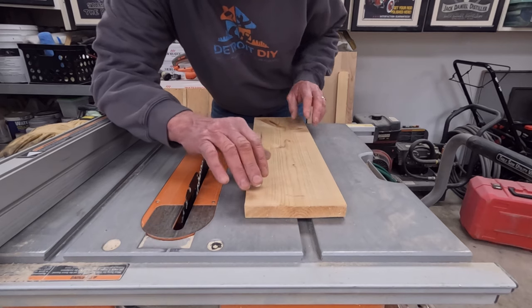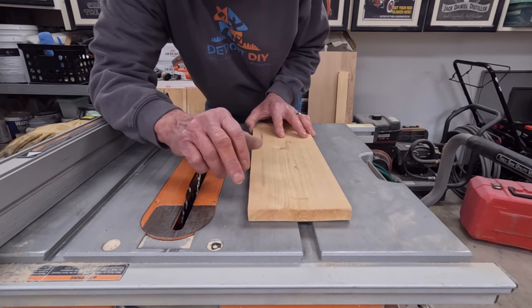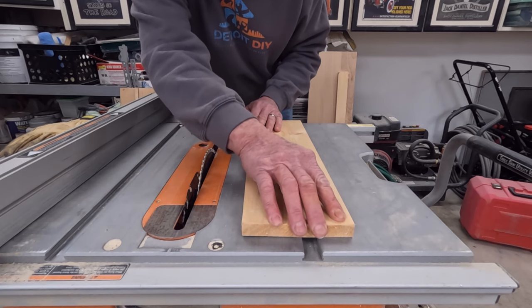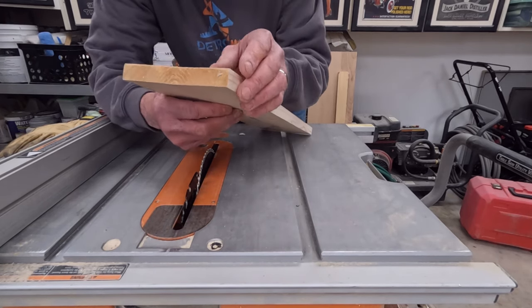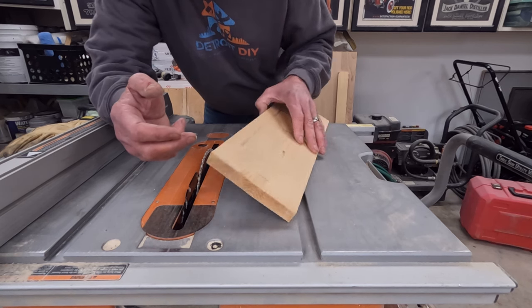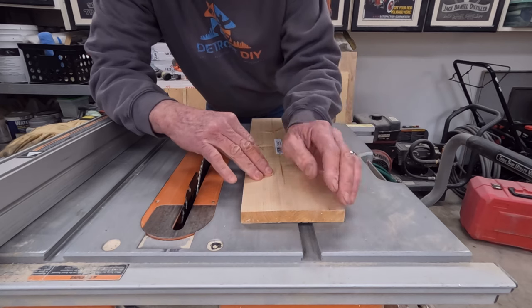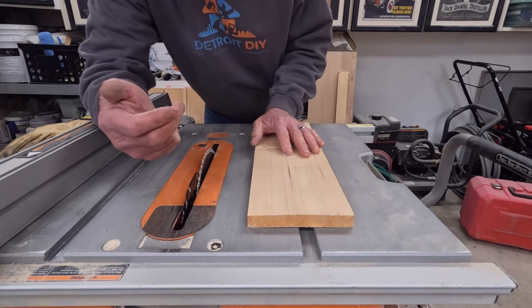Next, be careful of cutting bowed and twisted wood. A twisted board is not safe because as it goes through the saw you're not getting a 90-degree cut, and as you complete the cut the pressure you're putting on the board is going to change and it could tilt — providing an opportunity for binding. If you turn a cupped board over it would be much safer to cut, however you're still not going to get a true 90-degree cut, and cupped wood isn't really usable for a project anyway.